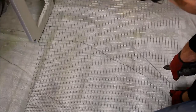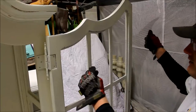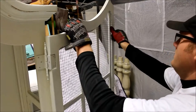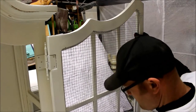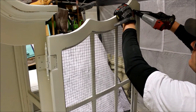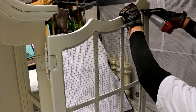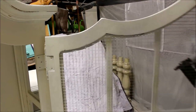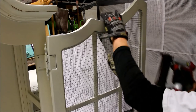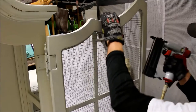The grinder is really loud. Now that I have my piece cut out, I'm just going to fit it in here, and if everything is right it should just slide right in. I'm going to put my first staple in — I've got half inch staples in here. You may have to adjust that depending on how thick your wood is that you're working with. I'm going to angle it up a little bit, and you want to use safety glasses when you're doing this because they can shoot out at you. I'm going in at an angle, and that holds it nice and secure. I'm going to put one about every three to four inches.